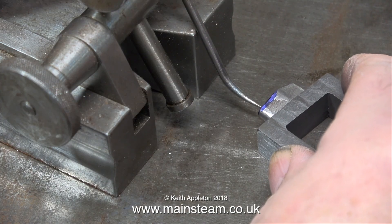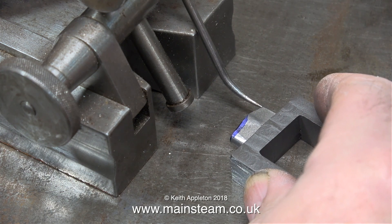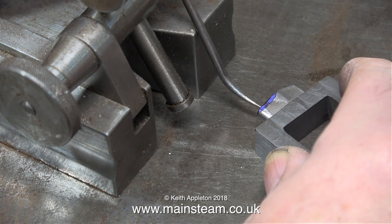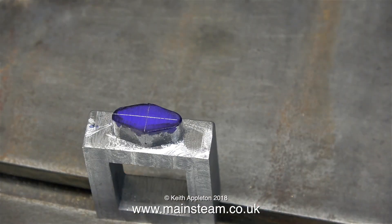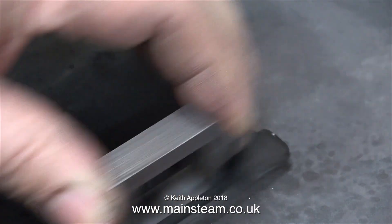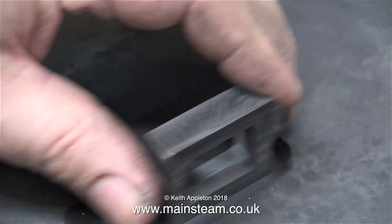Following the drawing to the letter, the center line needs to be exactly a quarter of an inch from the lowest part of the steam chest. It's important to get this right, and as you can see it's exactly in the middle both ways. If you don't have a surface plate you could always use a piece of plate glass, but you'll still need to buy a height gauge — a very useful piece of workshop equipment.